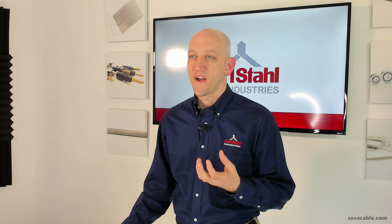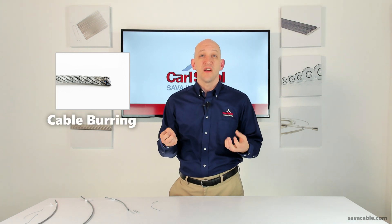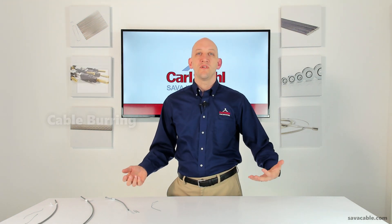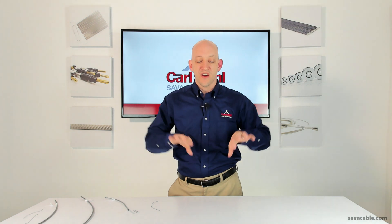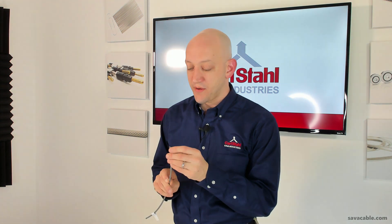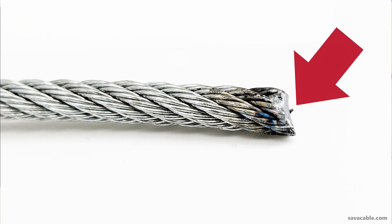Another issue is that the cable cut can introduce a burr. When a burr is on the cable end, it has a rough or sharp edge. With metal wire rope, that can cut or snag — a great comparison is if you're wearing a sweater and walk past a table and the threads get caught on the corner. The same thing happens with wire rope: a burr sticking out grabs onto the side walls and prevents the cable from feeding through. An example is this cable here, where the burr is actually right in the middle — it's sharp enough to prick my finger.